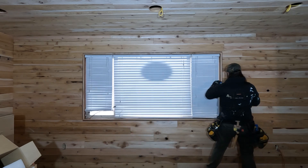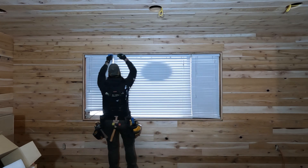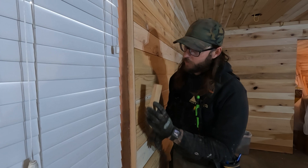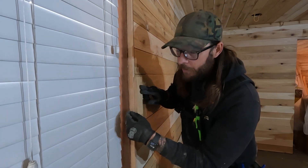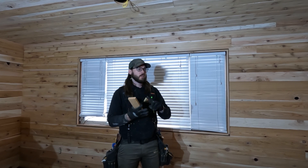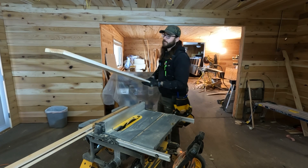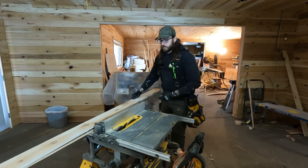I'll make a couple marks here, one directly in the middle, one up at the top, and again over on the other side directly in the middle. Just to give you a better visual representation: we have our new wall thickness and then our jamb extension. What that allows the casing to do is come up and sit nice and flush with the jamb extension and the wall, so we don't have a gap like we would have had without it. Now there are many different styles of trimming out a window — Mission, Cape Cod, Lintel style, Craftsman, Bungalow. This customer has decided to go with a Craftsman style. I have a piece of five-and-a-half-inch tongue and groove cedar with the tongue and groove ripped off, which leaves me about four inches, and we'll rip that down to two-and-a-half inches for our casing.